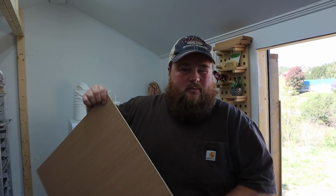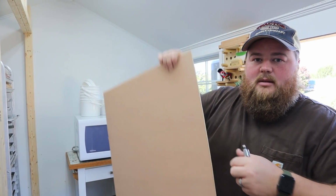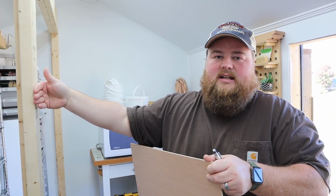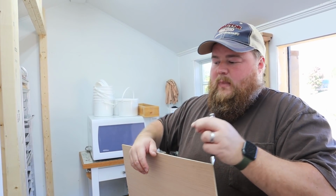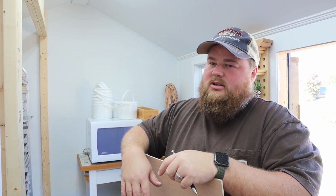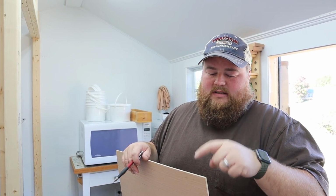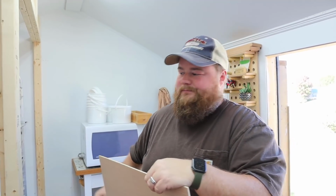So there's a look at how we're going to be paneling this thing. I have a scrap piece, laid it in spot, just grabbed my mark on this board right where this edge comes to. I can take it out, cut it with a circular saw, and get a pretty good fit. We're going to have a total of 4 pieces on this, so a little hodgepodge, but again, we're repurposing and not spending money for this, which is good because this stuff is, well, not cheap.